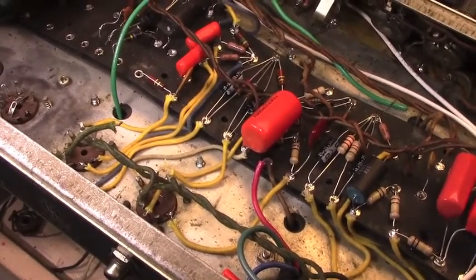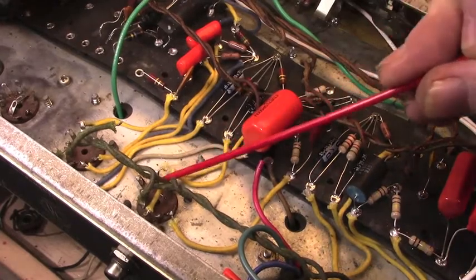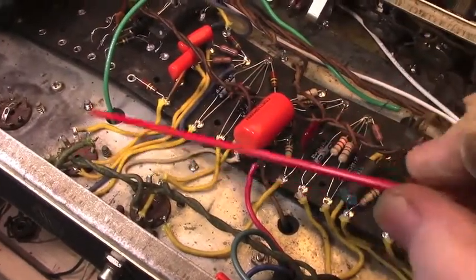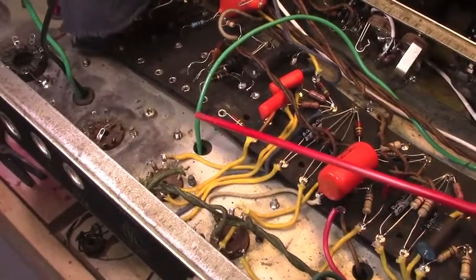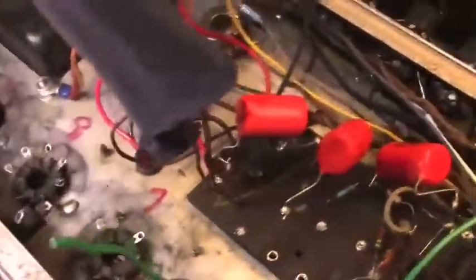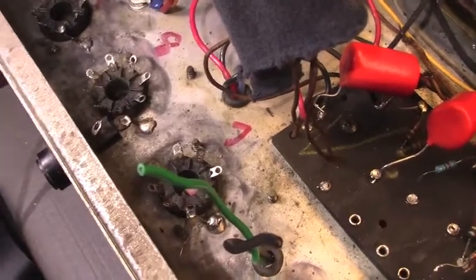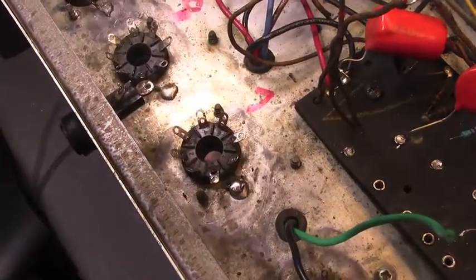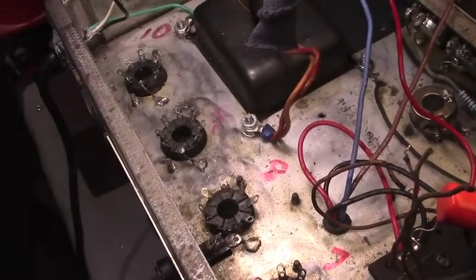I've got my preamp tube wiring all complete up to, let's see, V1, V2, V3, V4 is complete, V5 has not been done yet. It's the point where I've left off here, and I'm still working on other areas of the board, but I just reached a point where I said screw it. I was finding so much bad stuff, and if you look down here you can see I've completely stripped all of the wiring for the power tube sockets. It's all gone, every little bit of it. Got those grounds together for the power tube sockets that go to pin 8, and got everything nice and cleaned up and desoldered, and ready to accept new wires.